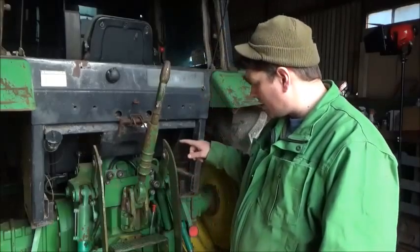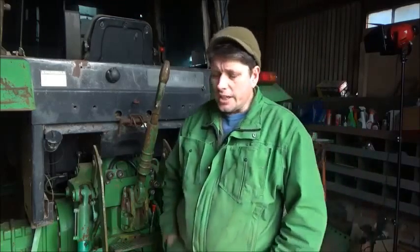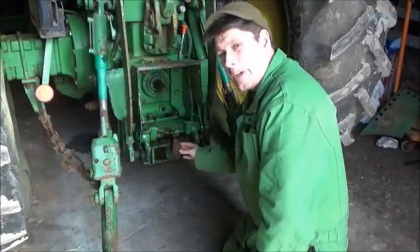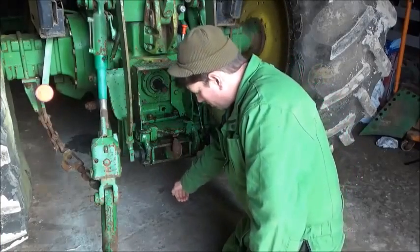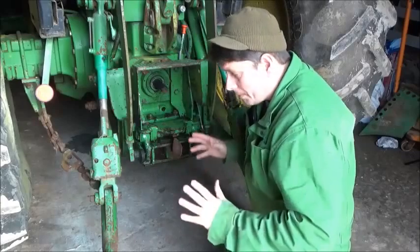This is a UK spec tractor and several of my American viewers have asked about our hitch systems. If you look at people like Iowa Dairy Boys and Ryan on How Farms Work, you'll see their trailer hitch systems are quite often different to what we use. So we have a hook in the back — a hitch — and the whole thing lowers down so you can back up and pick up into the eye of the hitch ring on the trailer or implement.